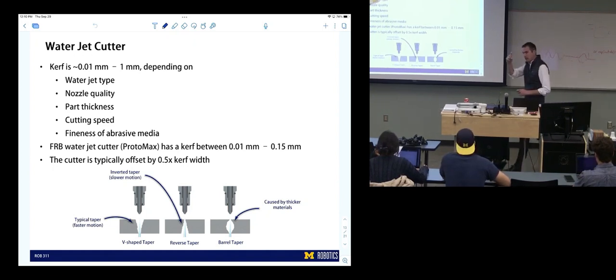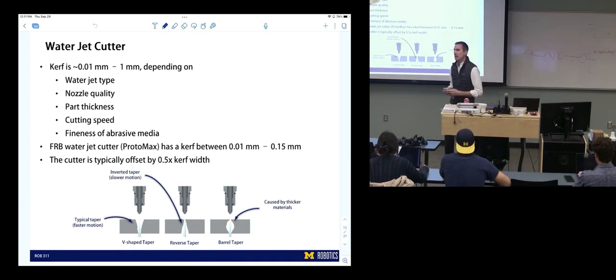So short nozzles will have a much higher pressure than long nozzles. Then why use long nozzles? I think there's sort of a mixing process that occurs. They call it something, but when the garnet goes through that tube after that, that's mixing the garnet in the water. And there's something to that on the manufacturing side. That length matters.